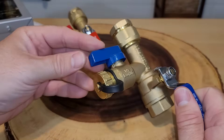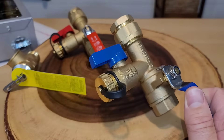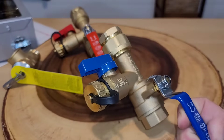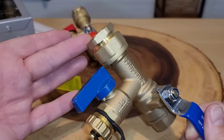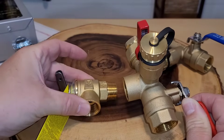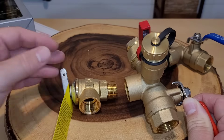These diverter valves let you turn off the water to the unit, then turn this valve to open it up and attach a descaling tool. About six months after my install I'll be doing a descale, and these valves are needed for that. On the top there's a union connection that connects to the bottom of your tankless water heater. The hot side has a spot to relieve pressure with the pressure valve, so I'll install that as well.